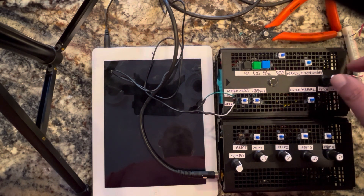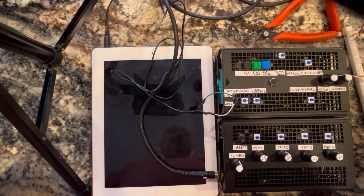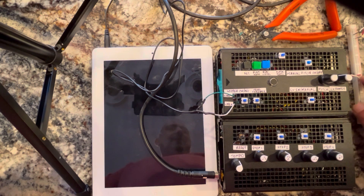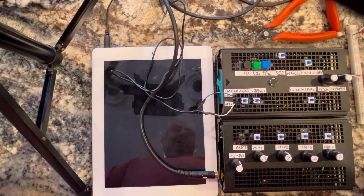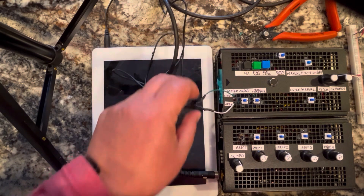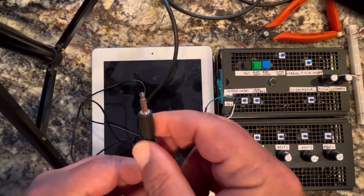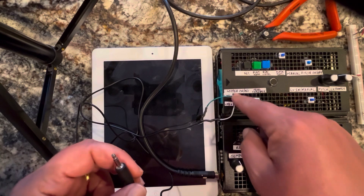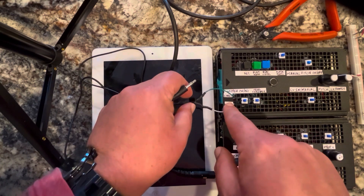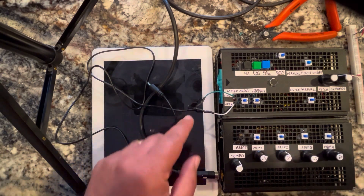The pitch is set by the manual pitch control. This is the record button, play edge, play level. This is the input jack. The only thing I have to fix is getting a better connector, because right now the power and ground are coming from this little piece of breadboard. This is the audio line in, connected through an eighth-inch audio jack. One side is connected to ground, and this side is connected to the actual line in which goes into the microphone input. It's basically a hacked cable.